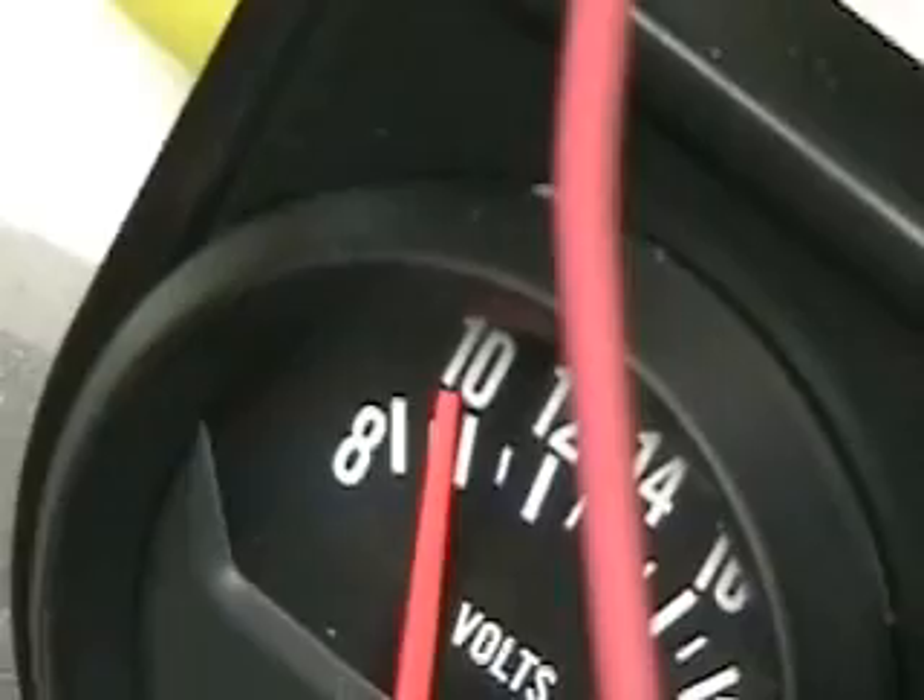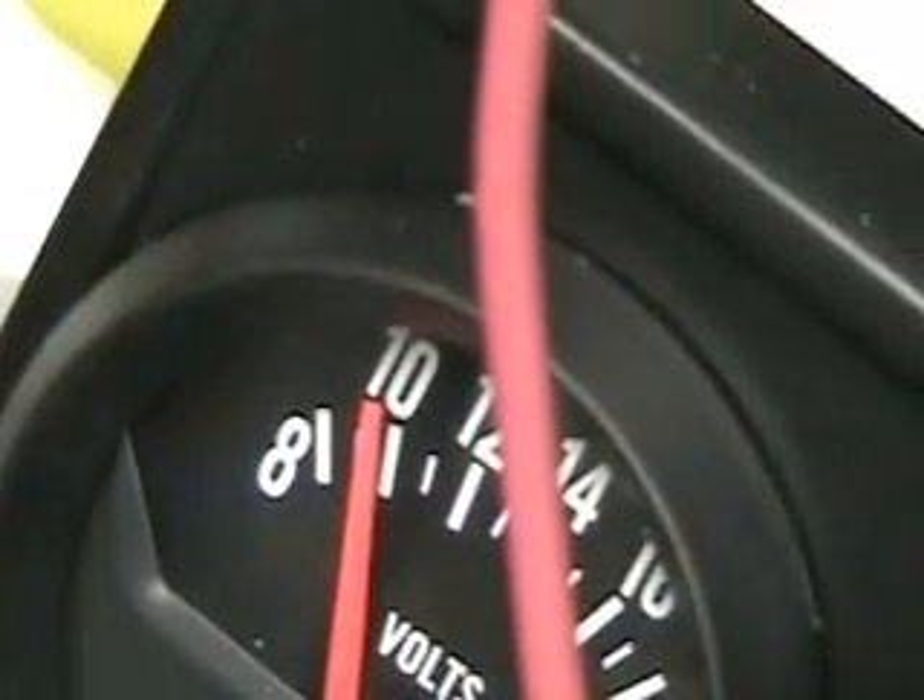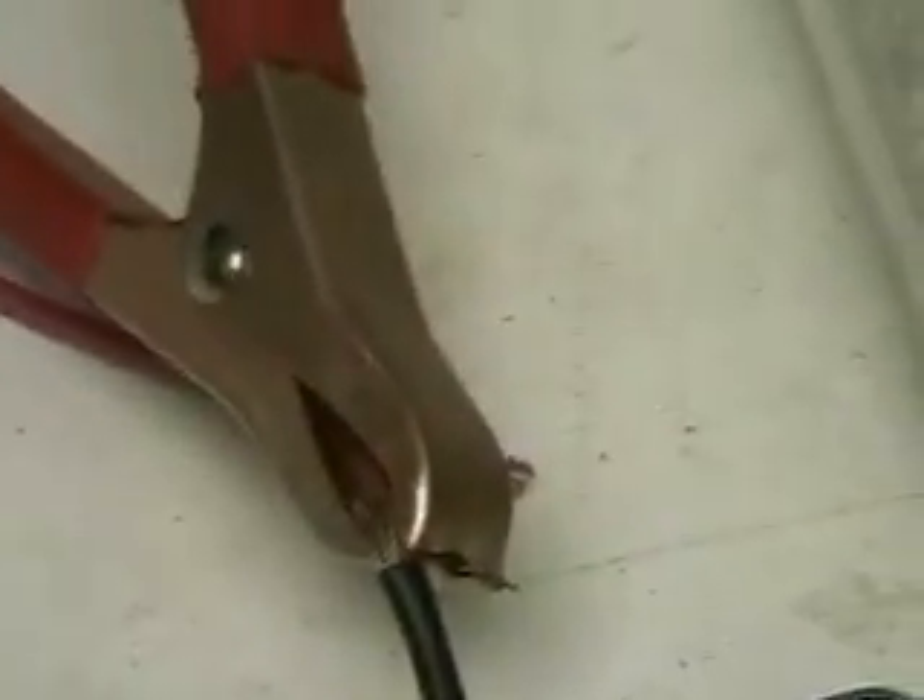I've put water on the top of the unit and as you can see, we're showing hydrogen leaking out. That's the voltmeter, and the volts are already down below 10 volts because there's no charger on the circuit. The amperage is over 30.